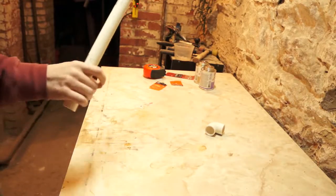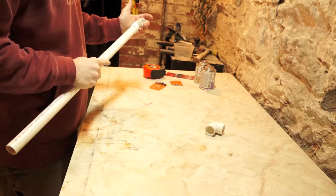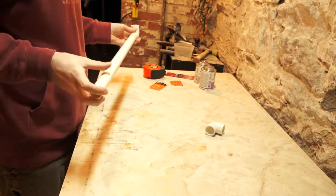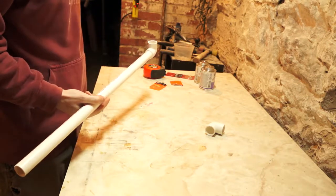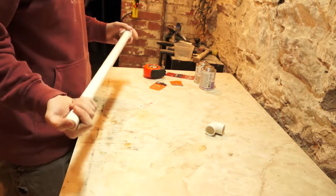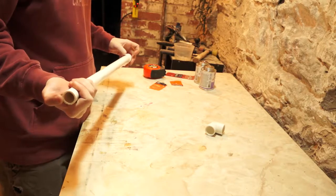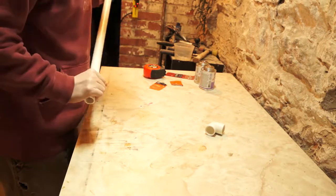Alright, we're down in the dungeon again, and we're going to make a hot wire cutter for the mold for the powder surfer. We're going to make the frame out of PVC, tension a wire using eye bolts and the inherent springiness of PVC, run a guitar string or maybe a mandolin string through it, and hit it with 12 volts to see if we can cut some foam.